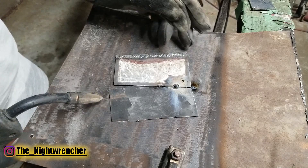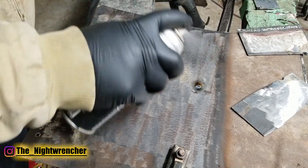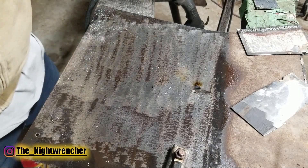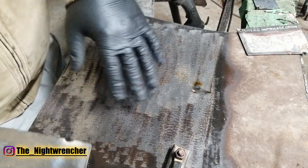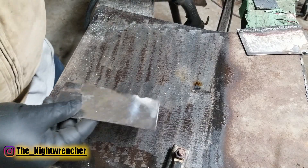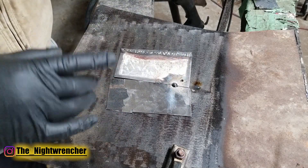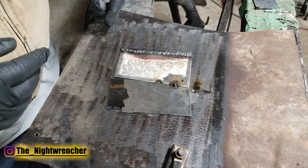I'm going to turn the settings all the way down to demonstrate this technique. Before I continue, I'm going to spray this down with anti-spatter spray. I spent a couple minutes cleaning off this piece of steel to use as a ground table since I don't have a welding table yet. Spraying a little anti-spatter spray keeps everything clean — it's pretty essential especially when welding flux core, as it helps keep all the spatter down and makes the metal look cleaner.